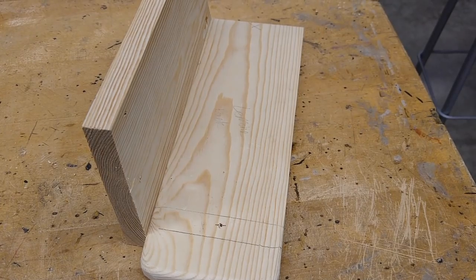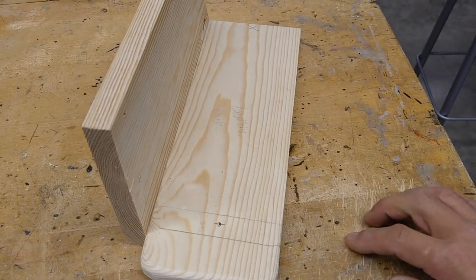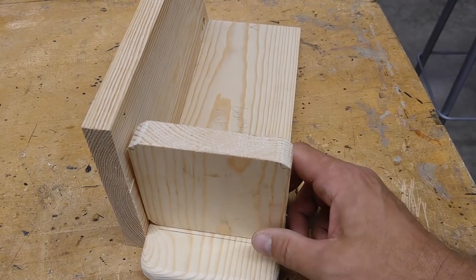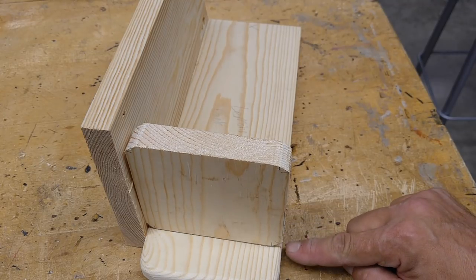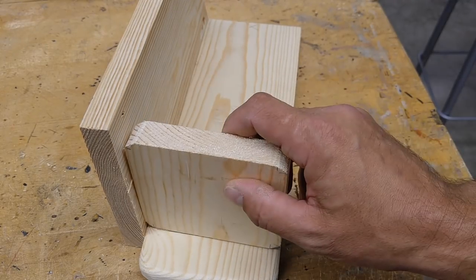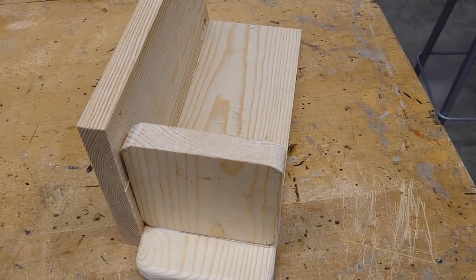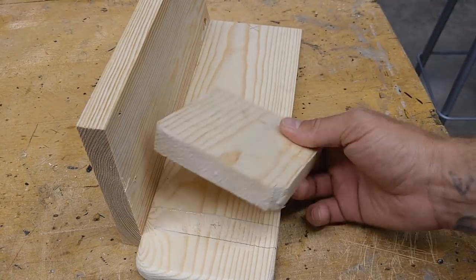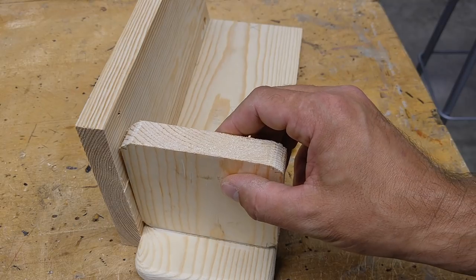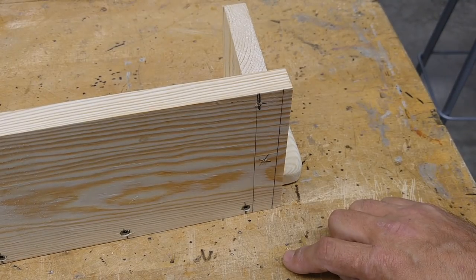Step two here — you do have to go in this sequence to ensure your success. I am focusing on the bottom. You see I've got lines there placed and ready so that I can put a screw through it. When you place this in, there is a right way and a wrong way. If you place it the right way, these edges are even with each other; if you place it the wrong way, they are not. Where this bottom comes in contact with the back and the side, we need glue. I've added glue to this piece on the two sides, smoothed it out, and placed it in. I am now going to rotate this and put a screw right through here — of course, I'm going to drill it first.